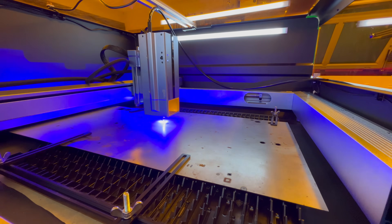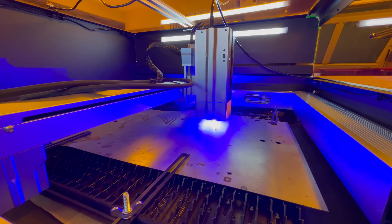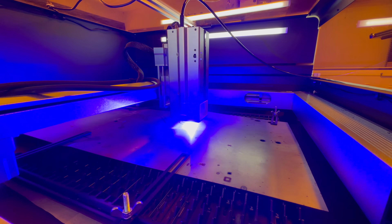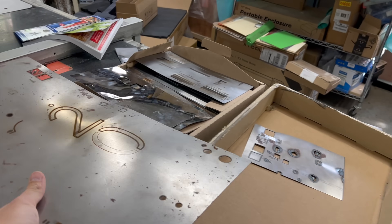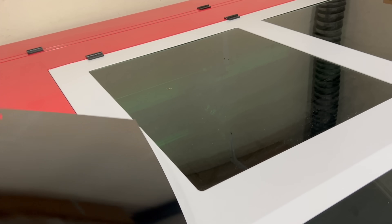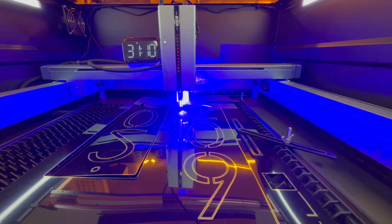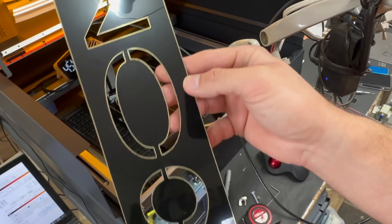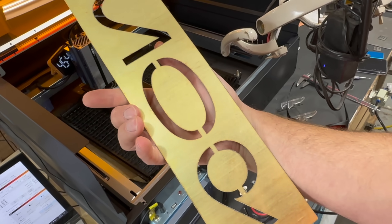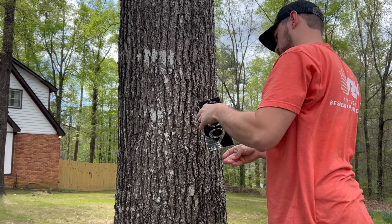I first attempted to make this with 22-gauge steel from Home Depot, but even though my small-scale test showed I could cut it in five passes, it warped badly on a larger project as the heat caused the laser to go out of focus. So I switched to 0.4mm black and brass colored steel. I ran into some problems running it too quickly, but slowed it down and cut it in one pass, keeping the metal from overheating. The black metal came out with a neat brass outline along the cut edge. I designed it to work with metal standoffs, which look really professional.